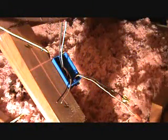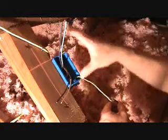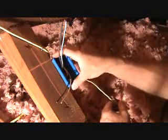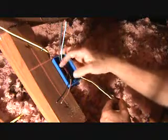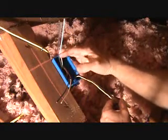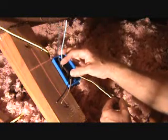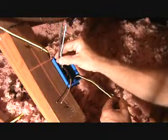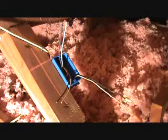What they used to do is at the light fixtures up in the ceiling, they would run power to the light fixture. Then they would take another set of wires and go down to the light switch. One wire was a hot wire that went down and fed the light switch, and when you turn the light switch on, one was a hot wire that came back up to the light fixture.